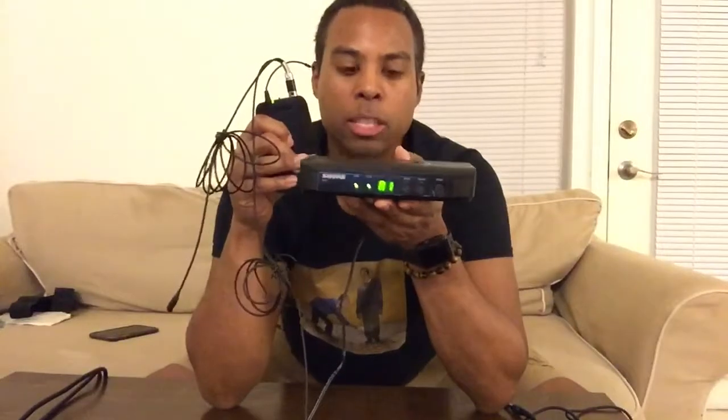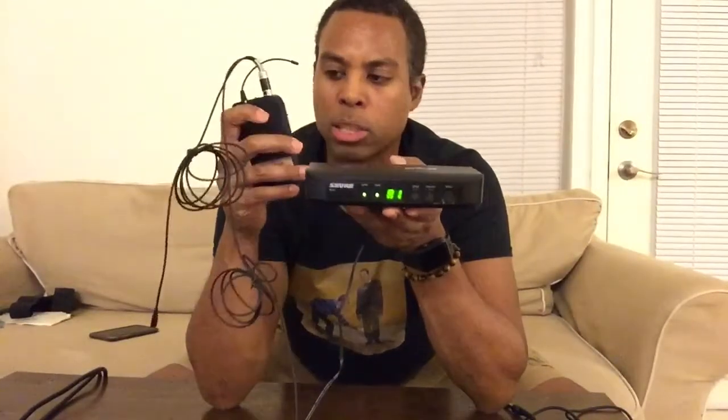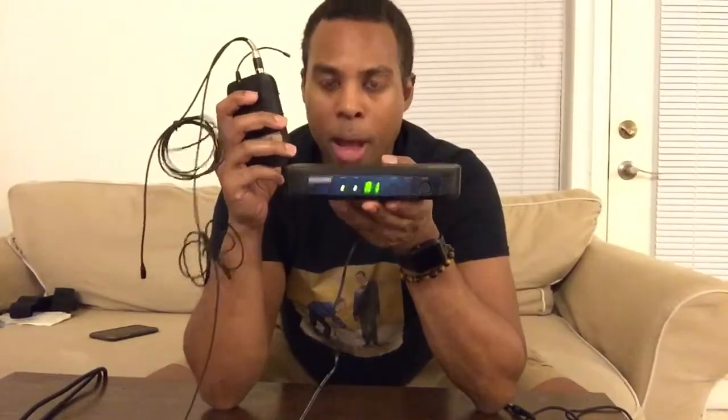This has A through Y channels. This is a Shure transmitter and receiver — it costs about $300. These mics are made to work with Shure transmitters and receivers. However, you can use them with other systems. You just have to make sure that those systems either have a TA-4F connector — that's the four-prong — or that you have a converter, which is a cord that takes your TA-4F into whatever connector is needed for that other system. I'll do another video to show you how that works.